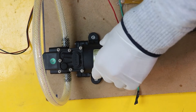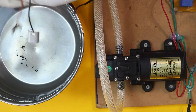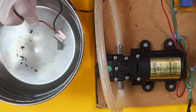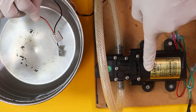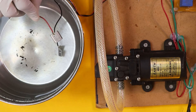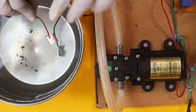Now, how will we fit the sensor? It will be like this — this is the water. One sensor will go down, and the other sensor you can set at a particular level. As soon as that level will be met, the motor will automatically cut. So this is why it is called an automatic solar water pump project — it automatically turns the motor on and off according to the level you have set.